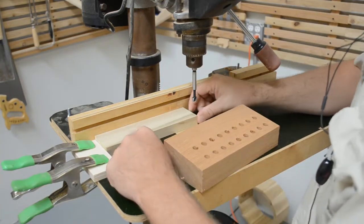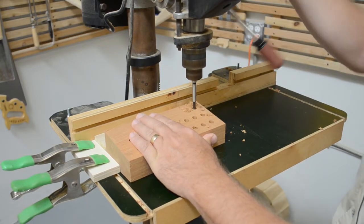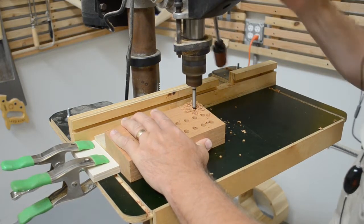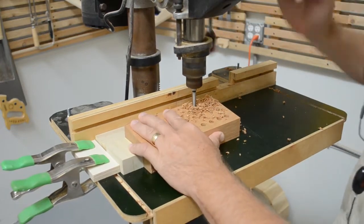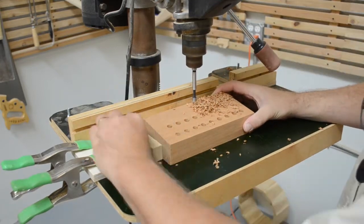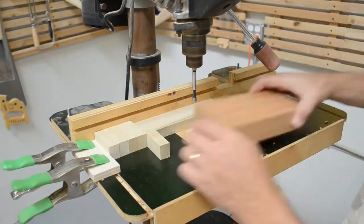The rear spacers should be close to the same width as your workpiece, and the side spacer blocks need to be cut long enough so that they reach the workpiece even with the back spacers in place. This is an easy and very accurate way to drill rows and columns of holes. The spacer blocks can be whatever dimension you need, and the spacing doesn't have to be the same side to side as front to back.